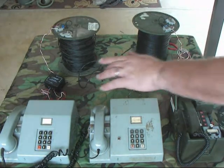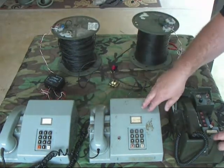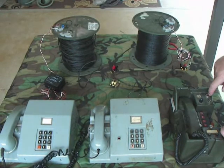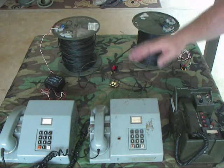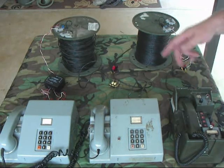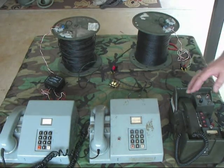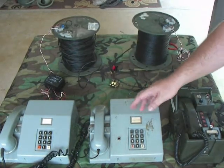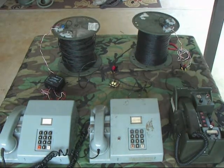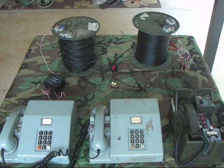I'm going to pick this phone up — both the other two should ring. We've got our light here and our audio indication. Now, one thing to remember when using four-wire phones is they use a tone sent back and forth that's roughly two seconds long. When you answer a call, you have to wait a few seconds because the answering phone sends a tone back, then you can talk as normal. Everybody needs to know this up front so they understand how it works.